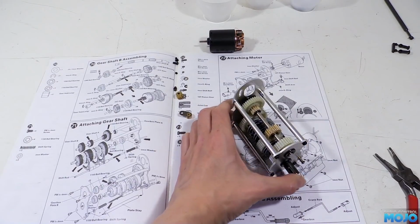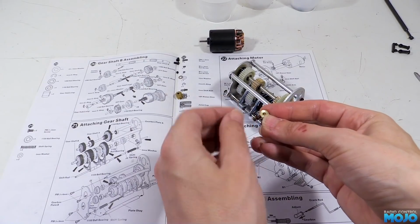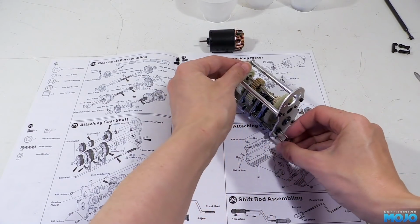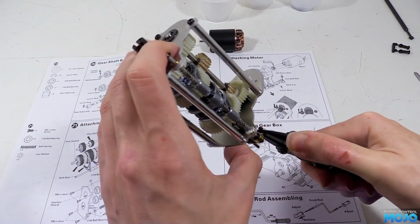Next we've got the shift arm, and just like the cup we'll use a bit of thread lock on the screw. This time it's the end of the 4mm ball end. The brass bit goes up against the E-clip and the hole in the steel plate runs up and down the small rod to keep it straight. Nip up the ball end and it's ready to go.